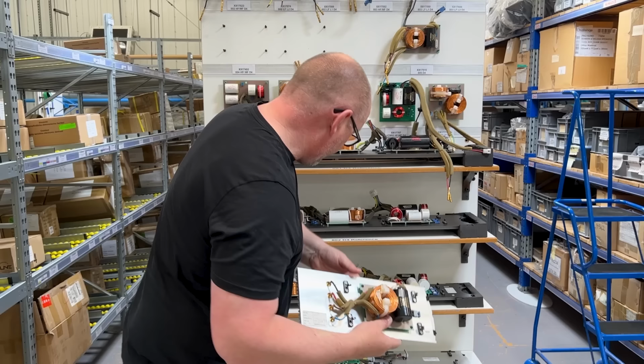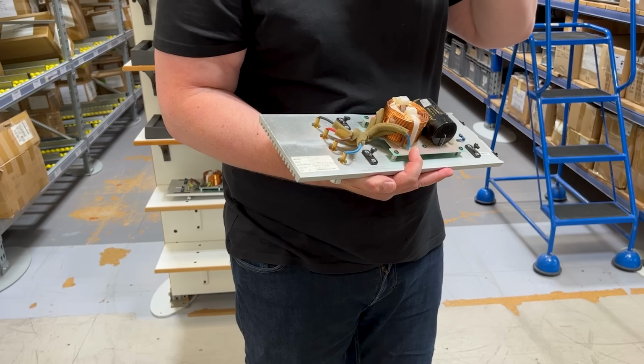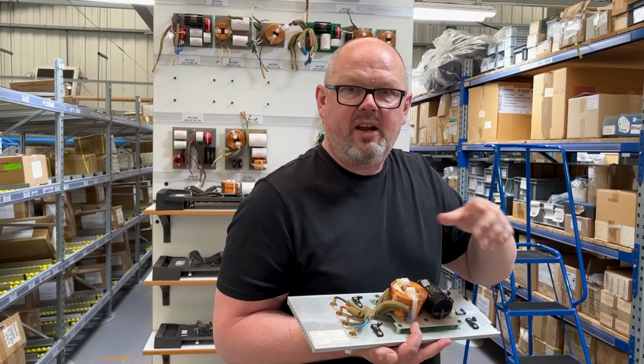All of these are reference boards. So if you look, they've all got Steve Pierce's squiggle there to show they've been signed off, and the date, 2021 in this particular case. So these are used essentially to test and verify the calibration data, which is why they live here. So the process is, at the start of a build, you take these off, you'll measure this. This should measure to the stored calibration data, because in theory, this is what you're measuring. Therefore, subsequently, each one that you're making should measure back to this. You can be sure of what you're doing.